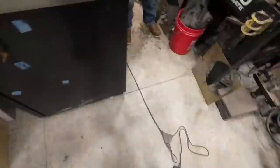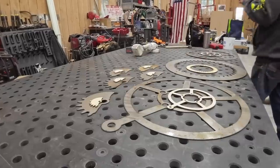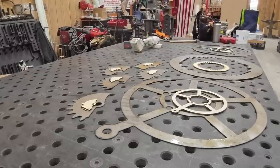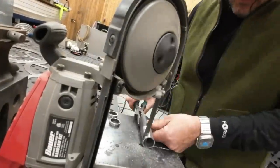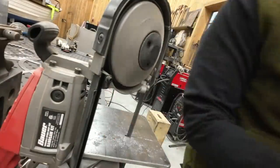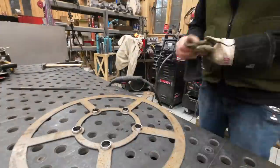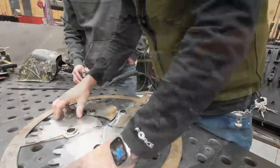We began putting it together. In Matt's video you'll see him and Patrick cleaning up all the metal. In my video I just jumped right in. We got all the burrs off, took some time and sanded everything. There you can see the comparison between the original prototype parts and the freshly cut metal. Now we need to develop pivots — I'm cutting this one-inch tubing, which is going to be our pivots. Everything's low profile now because we have three layers of steel, and this steel is only maybe 14 gauge. It's thin.